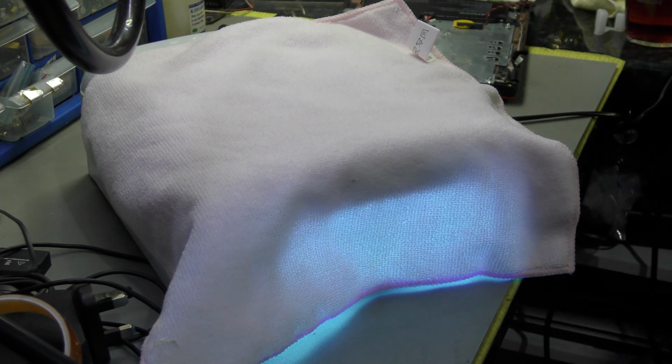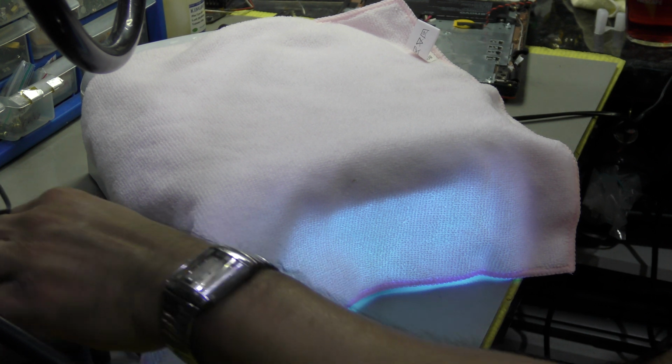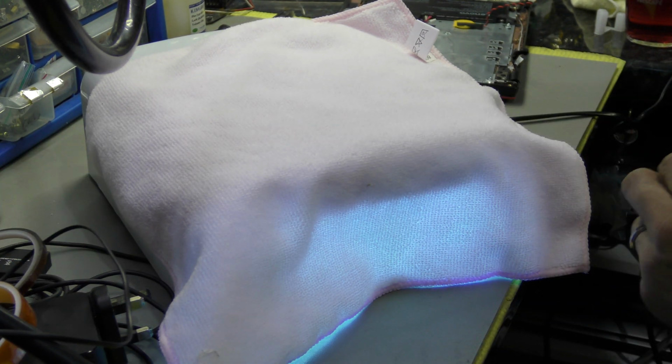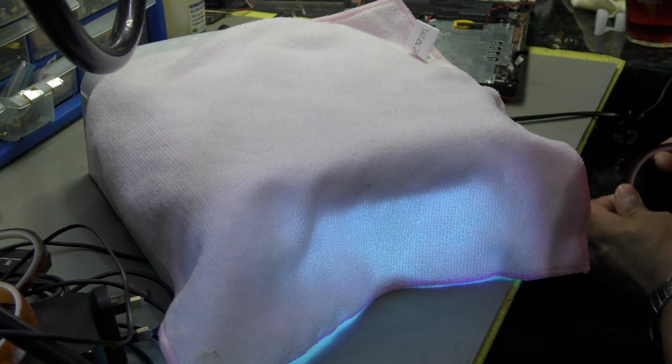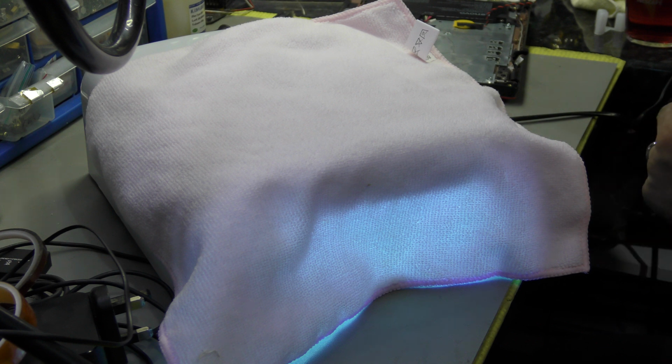And now it seems to be fitting in quite nicely, but my concern is that the 19 volt pin, I don't want this to be touching anything. I don't want that to be shorting anything out, so as a result of that I'm minimising the risks by applying a bit of solder mask on it, and at the same time I'm going to maybe put a thin layer of Kapton tape onto the back side of the palm rest.